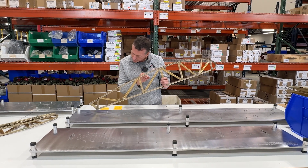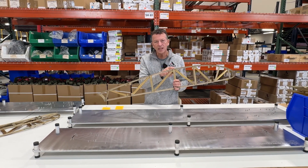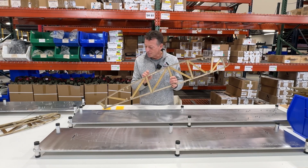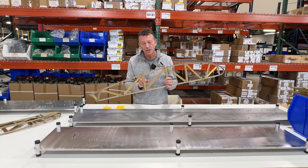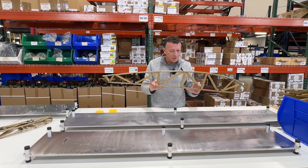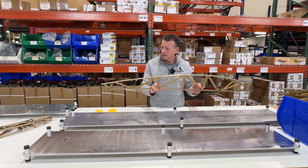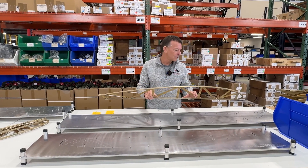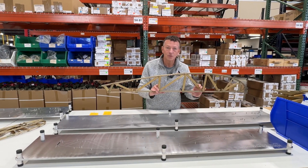The original cap strip was 0.012 inch thickness, and we moved it to 0.016 inch thickness. So that increased the weight a little bit from the original Piper, but not a lot. It's a little bit heavier than the original Cub rib, but it's about 20 pounds lighter than the certified ribs you can buy on the market today — and that's the real value proposition.